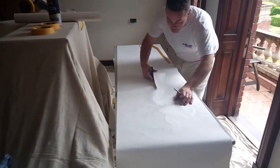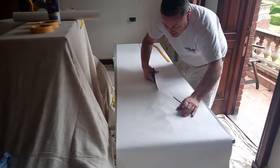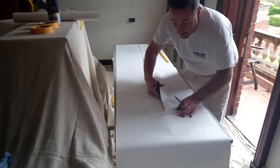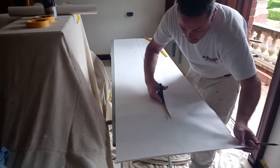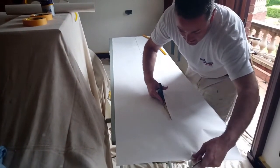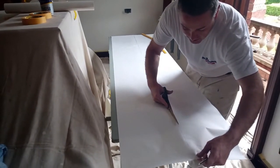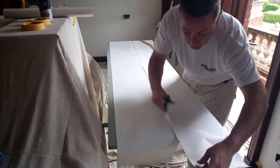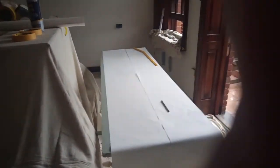I'm following it all the way up. If you're slightly off the line, it doesn't matter too much, because don't forget this is the edge that's going to go into the angle and then back out as an overlap. Come up there and hold that there, all the way up - done. Easy as that. That's how you properly cut a piece of paper off a full width - just over 10 inches there - and then the rest will be the rehung. So that's that. Thanks Brian.